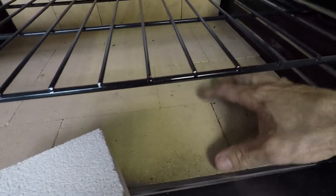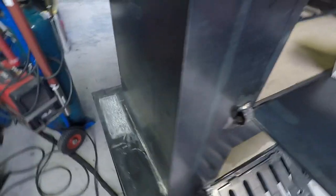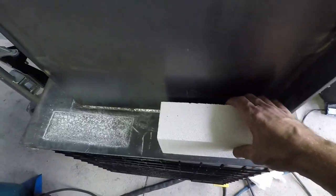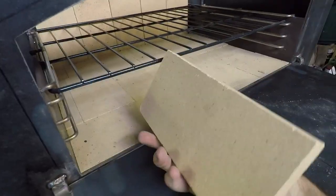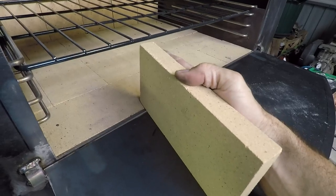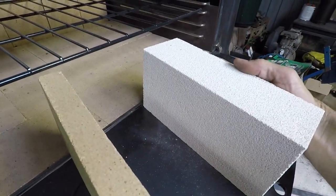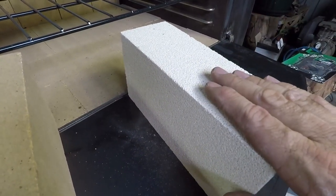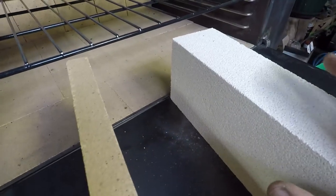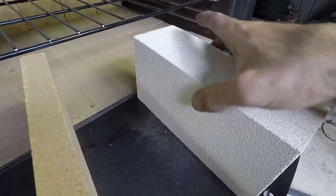Obviously where you cook, you don't want insulation — you want a heat sink. So the regular fire bricks hold heat, while the insulating bricks resist heat transfer. A layer of insulating bricks on the bottom, then a layer around the sides, plus an inch of ceramic pad, and then stone on the outside. A normal fire brick costs about $4.50 Australian; insulating bricks are about $6 — similar price but completely different purposes. One mistake you definitely don't want to make is using insulating bricks in the cooking area because they'll just insulate heat and the oven won't cook properly.